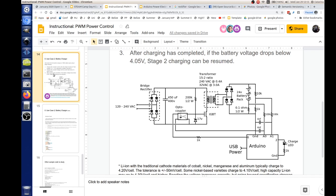Unless that charge is a trickle, in which case it can handle it, and once it gets charged up, the other one starts charging, right? Well, even if you trickle charge, the same current goes through all the batteries. Not through all of them, it depends on their resistance. If they're in series. No, but in parallel, you have no guarantee, trickle or max charge, whatever. Okay, but with a trickle, that's within the capacity of a single cell. So once that cell fills up, its resistance goes up, right? So then you start trickling over to the other ones, right?